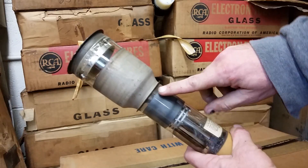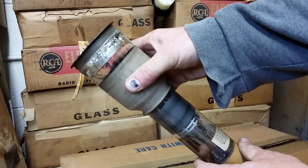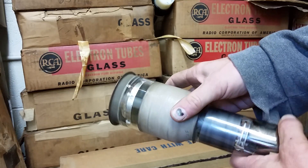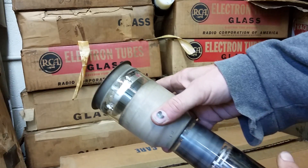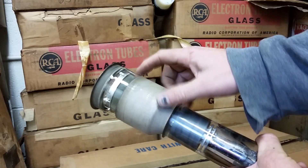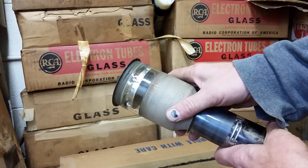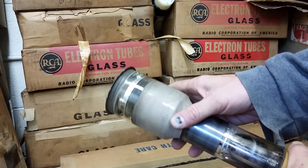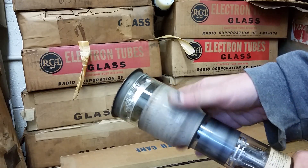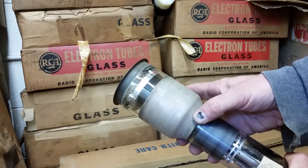From here down is more or less a CRT. This one's electrostatic. Let's see if we can see in there. A little hard to see, but you can actually see two of the deflection plates; the others are probably under that shield. The big innovation with Raticons is this structure right here inside. That is actually sort of like a big capacitor. The idea is electrons shot from the gun get deflected and the beam will land somewhere on this plate. The plates are generally made of mica with metal backing, and the charges will stick there — electrostatic action.